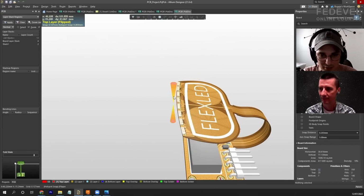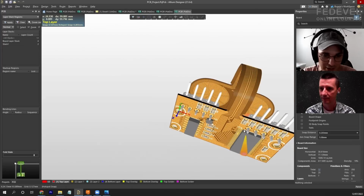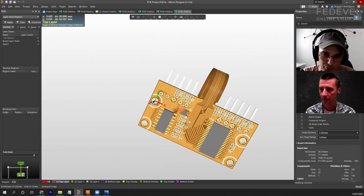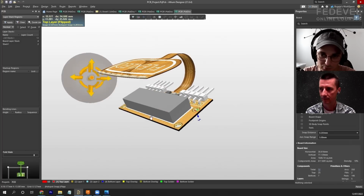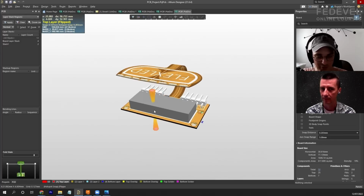So it has 2 coils and a couple of RGB LEDs. And then it has an LED driver that can control the current and the color of each LED, and make sure that it's also because this one is a constant current driver. And then I have a microcontroller that controls the color of the LED so that it could display some words or some animations. The main issue with this project is durability, which I have another video planned. I'm currently testing the durability of flexible PCB.